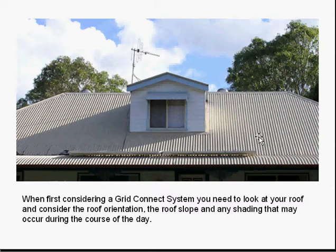It's better to have it on a slight angle, but in this case we couldn't put it on an angle up the sloping part of the roof because of the shading. This photo was taken late afternoon — you can see there — and in the early morning you had the same problem on the other side, so it wasn't any good putting the panels up on this part of the roof, so they've gone on the veranda roof, which is okay.